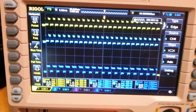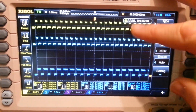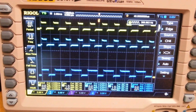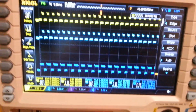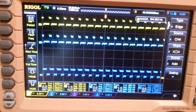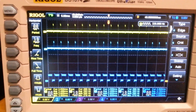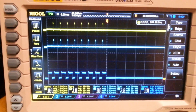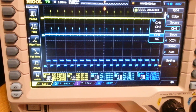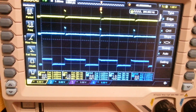So the idea with this new Oneshot protocol is that you synchronize the main loop to the output signals. So let's see what it looks like. So this again is PWM. I'm just going to quickly enable the Oneshot feature, which is new in Cleanflight, and then if we save that, we should see a very different pattern. So the flight control is just initializing now. Right, so if I resynchronize this, so synchronize this with the output signals here,